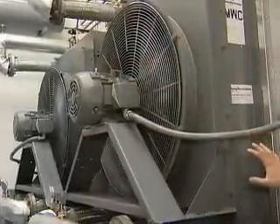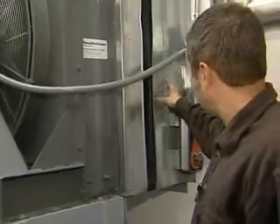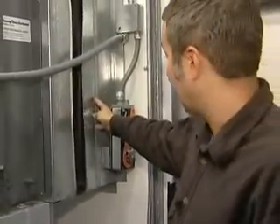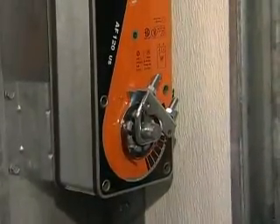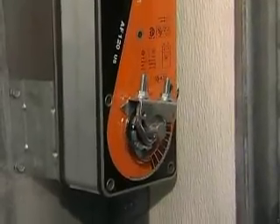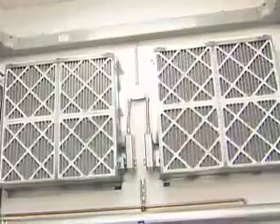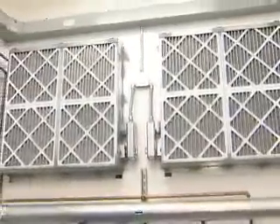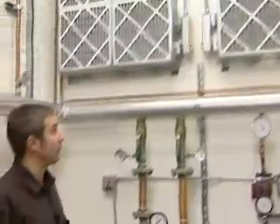Now we're going to go through the operation of the radiators themselves. Each radiator is ducted out the wall. Where it penetrates the wall, we have a motorized damper. When the radiator is not operating, this damper is closed. When the radiator operates, this little motor operator turns 90 degrees and opens the damper to discharge the air out through the wall. Associated with each radiator is an air intake damper — the duct through the wall has a motorized damper on it. When the radiator operates, this damper opens to allow fresh air to come in for cooling. We've also installed filters on these intakes to cut down on the bugs and dust brought into the room.